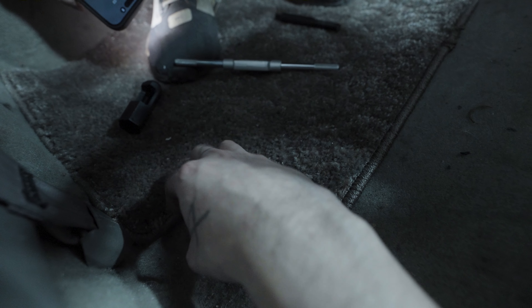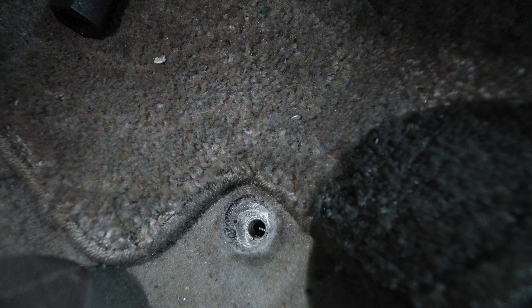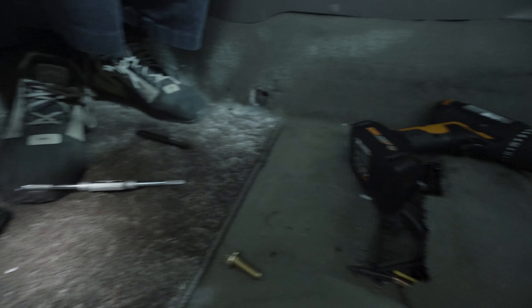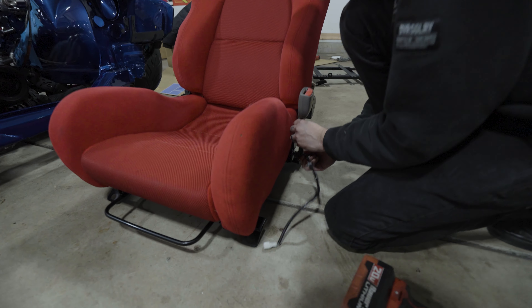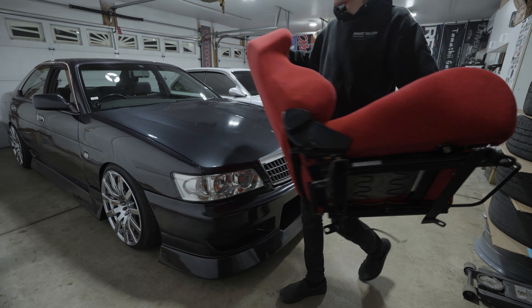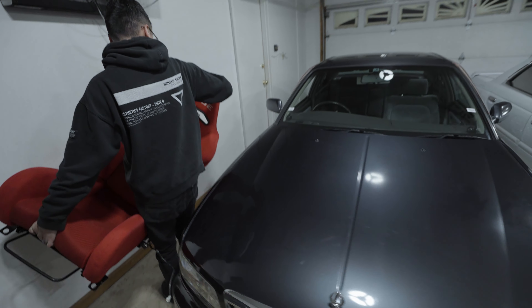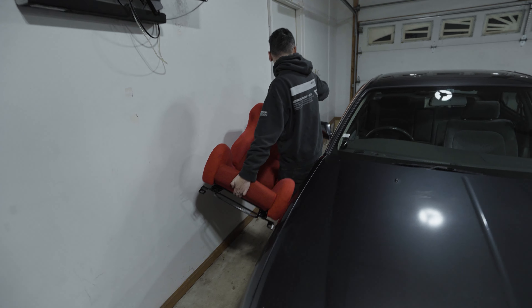Now that the hole is tapped, here's the helicoil kit — you just turn this all the way through until there's a stopping point where it catches and you can't turn anymore. Then once it's closed all the way in, you unscrew the tool and now you have threads. One more thing — on the end you see right there, you just grab a punch and punch it down.